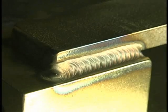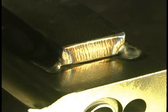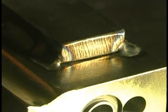I'm welding some more of these little weldments made out of 303 free machining stainless steel. First thing we did, we set it at about one pulse a second and left the wire in the puddle and just moved. I tried to move it along maybe a 16th or an 8th of an inch while it was on the high side of the pulse, and while it was on the background I kind of paused. That gave me a pretty decent little ripple pattern. This gives you a ripple pattern just as if you dipped rod in and out. It kind of kept the heat down a little bit, and the puddle stayed from getting too big.